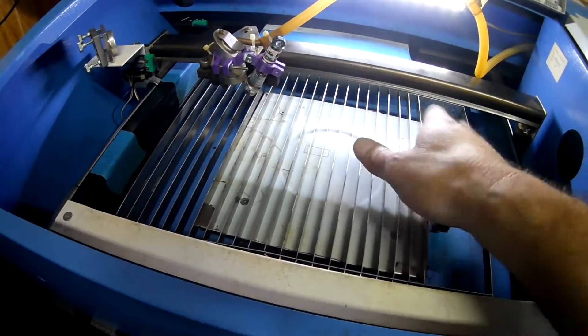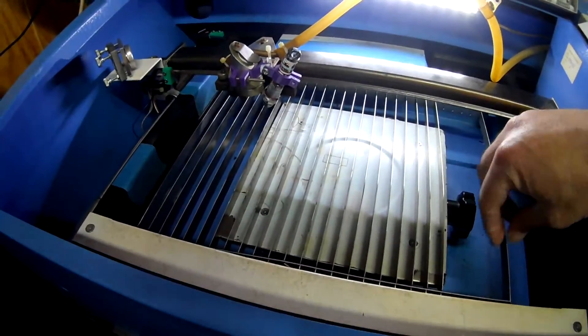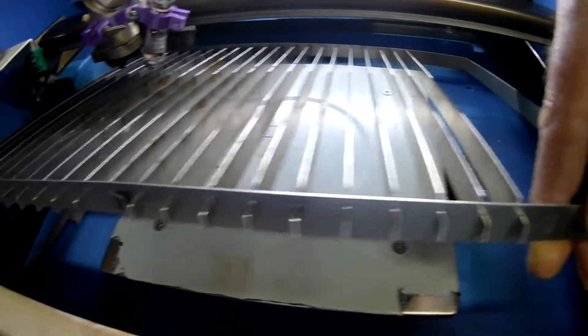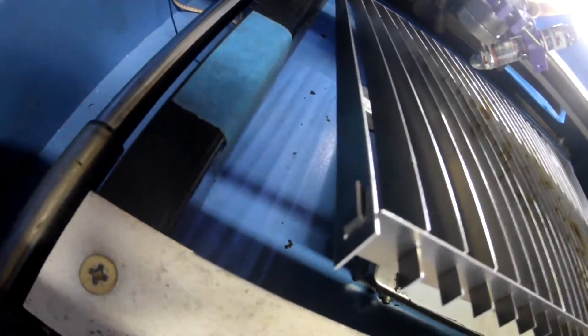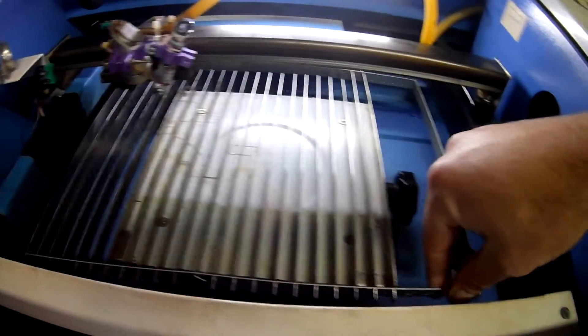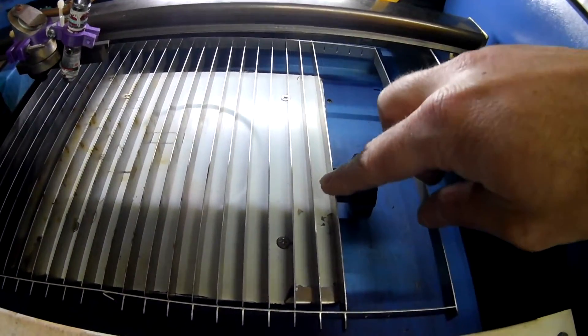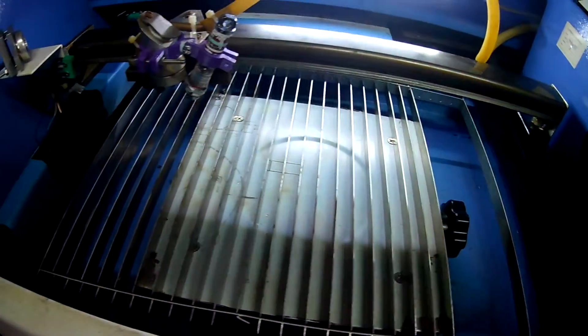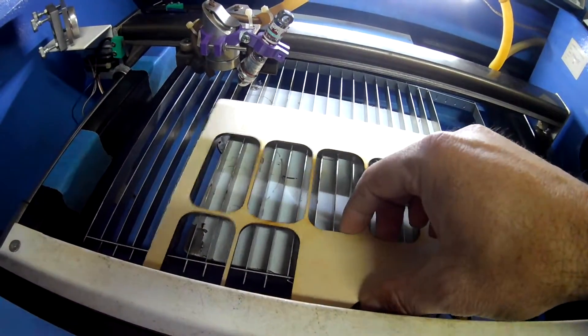So I've added this lab jack and this blade bed — a little different than the typical honeycomb beds I see on eBay. This is real thin 0.032 aluminum and it goes together really easy as a kit where everything just slots together and you bend over tabs to hold it all. It's thin on purpose to keep the width of these blades as small as possible to reduce the amount of back burn you're getting on your pieces.